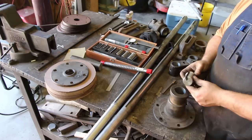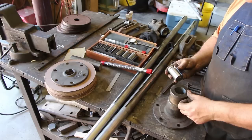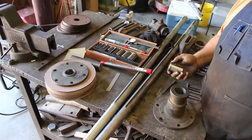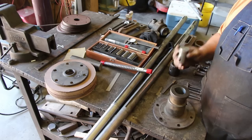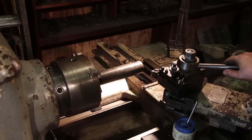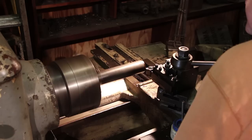We need to make a piece that looks about like this. The diameter needs to be an inch and three quarters, and the depth is four inches, so I'll make the length the entire four inches so you'll have backing that entire way. I've got a piece of inch and fifteen-sixteenths shafting that came off the matcher project from the old shaft - we'll use that as a contributing piece of metal toward this project. Let's go over to the lathe and turn that out. I'm going to start by facing this in, just cleaning it up, then turn it to inch and three quarters, four inches deep.